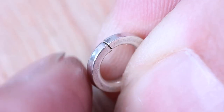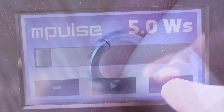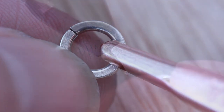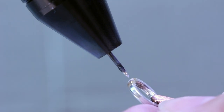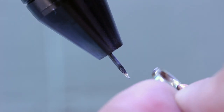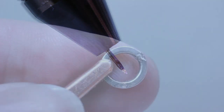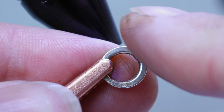So let's try something bigger. This is a large thicker square jump ring — sterling silver. For this one we're going to turn it up a little bit more so we get more penetration and more heat into the metal. Attach the crocodile clip again and just touch it to the electrode. Click and we're done. For larger items one spot might not be enough but you can apply a few hits from different sides to create a much stronger and cleaner weld. Increasing the power makes the weld spot bigger but it also penetrates deeper into the metal too.